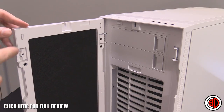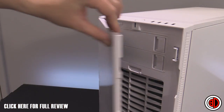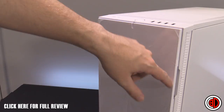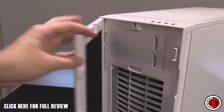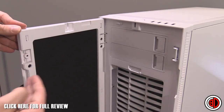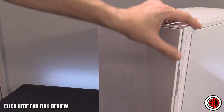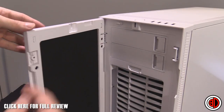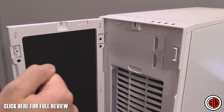The clever thing is the hinges stay in place and the hinges are now the latches. When you push the door closed, the hinge goes to where it would have been on the other side, with just that locating screw. They're not magnetic latches anymore, which means you do have to give them more of a push, but once they're on there you can really feel the latch.